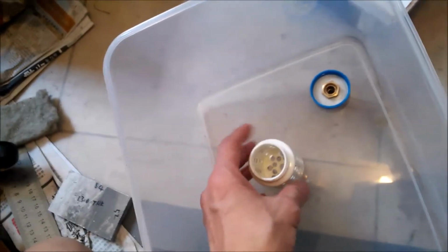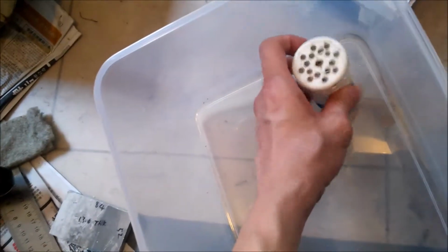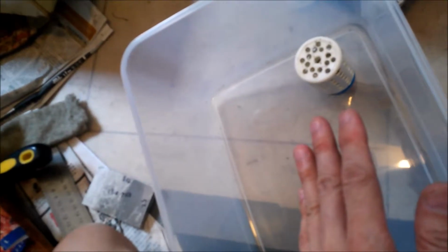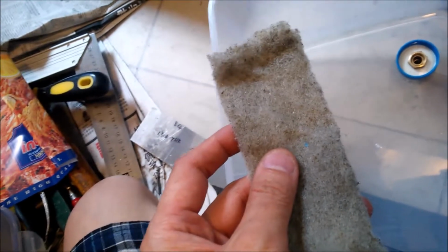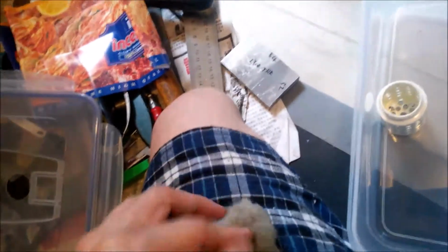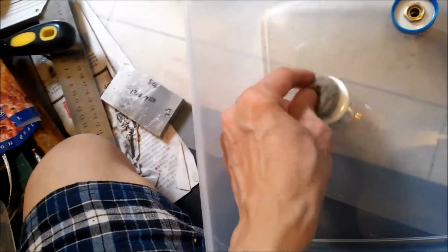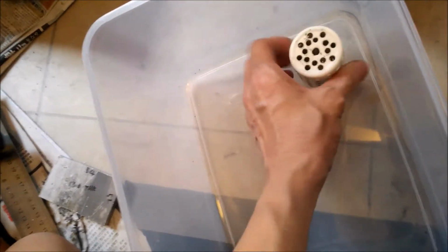And what is the purpose of this? The coolant will be at this level, and before going into the pipes and to the pumps, I need the coolant 100% clean. So this is the filter. I will put on this filter. This one is already used, so it's dark in color. I will roll it into small size and put it inside here. And then turn it onto the cover.